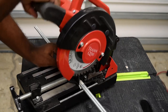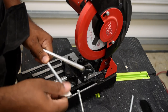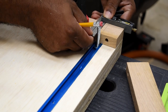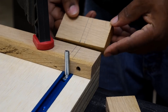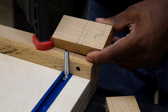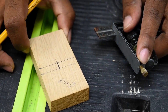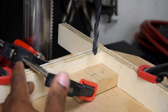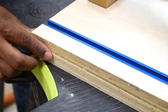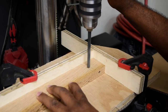Now cut the two threaded rods to extend just beyond the base of the jig. In order for this to work correctly you're gonna want to be dead on. I find it easiest to slide the bolt in the T-track and then mark a line on the outside of the bolts. I'm also gonna transfer that to a piece of scrap wood and mark an end on one side so I know which way to set up the jig at my drill press. Find the center of this — setting up a jig at the drill press will allow me to make these holes much faster. With the test piece this actually looks good, so now I'm confident I can transfer this over to the other pieces and move on.